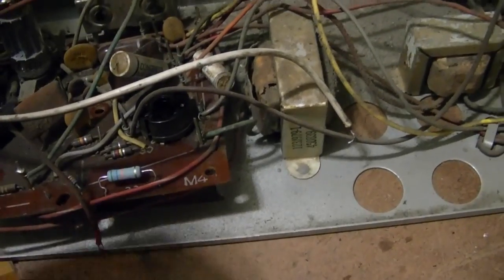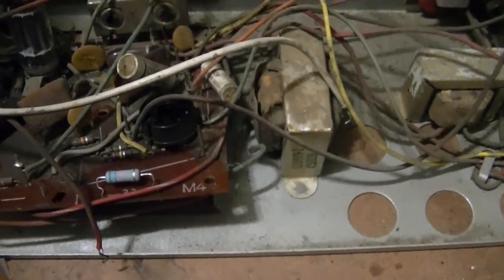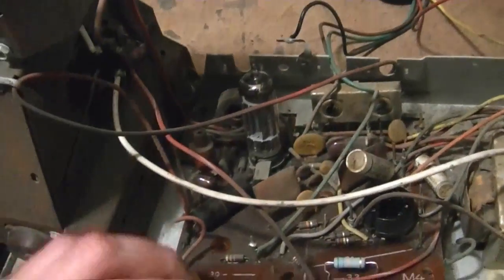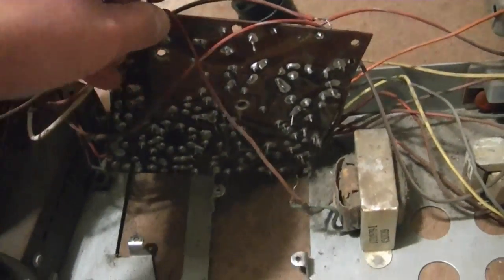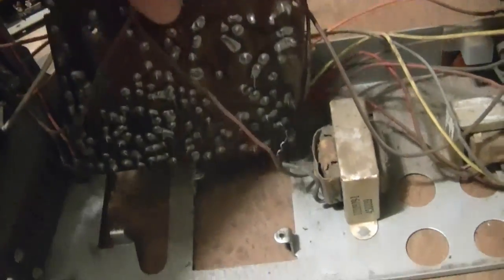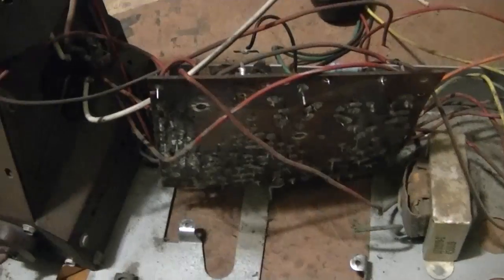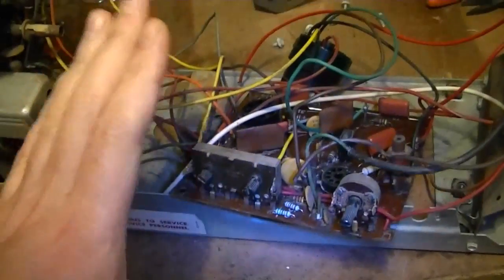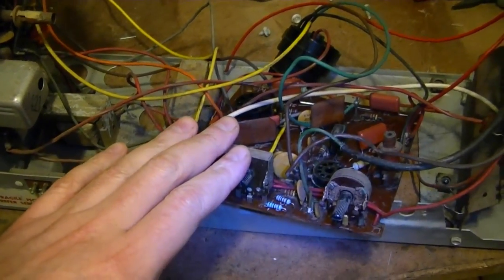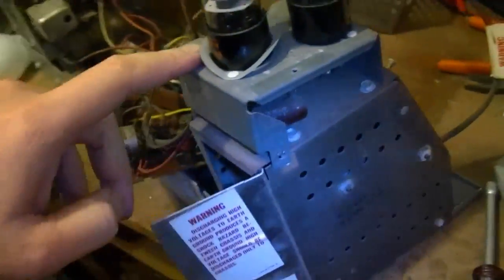As I had hoped, all I needed to do was unwrap that one short wire going to the transformer and undo some of these wiring harness thingies, and the board tips up completely, so I will not need to remove any more wires to recap this. I'm pretty much done recapping this board and replacing out-of-spec resistors, so now I'm moving my attention over to this.